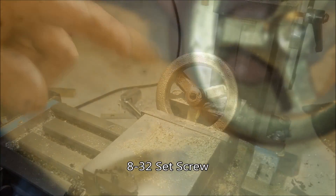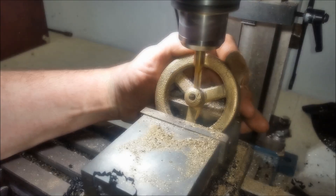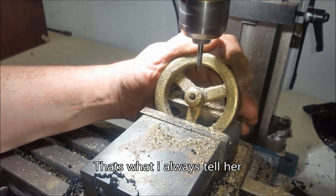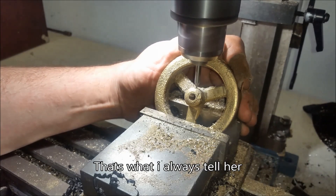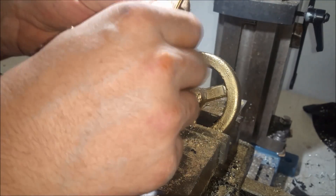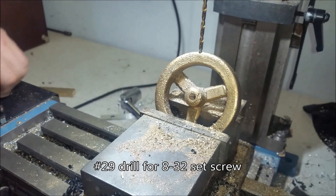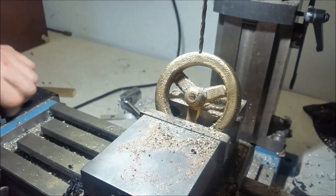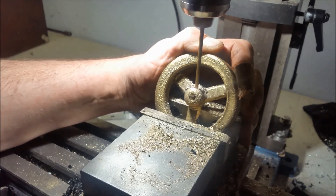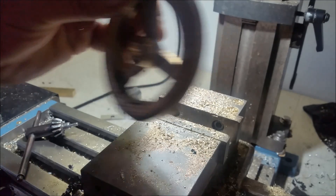Let's head on over to the mill to drill a hole for an 8-32 set screw. I'm going to start by putting a flat boss here on the hub. So now I just got the hole started, and I am just holding that in my hand — I know it's braced at any angle, so don't try this at home. This is why I've got band-aids all over my fingers. The number 29 drill for the 8-32 set screw. When I run the reamer through the center you can see the chips in there — little chips of metal — and then we're going to tap that 8-32.